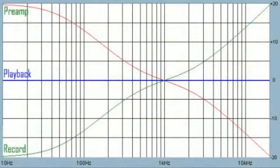Then the manufacturers decided that it was difficult to reproduce the bass properly because, let me bring this back up one more time. If you see at the bottom of your slide, it says 100 hertz, that vertical line. Well, 60 hertz, which is hum, is just to the left of it, and you're turning the volume up a lot there. So if you have electronics, they have to be ultra quiet in order not to get a bunch of hum in it. Also, speakers were not always able to reproduce the low frequencies.